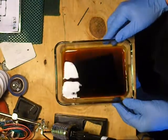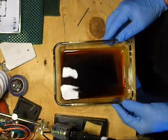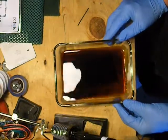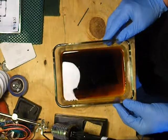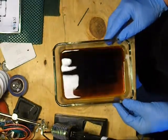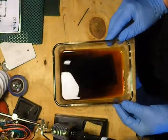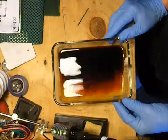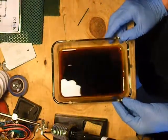It's been about five minutes now. One thing recommended that I didn't mention before: agitate the solution ever so lightly, just back and forth, creating a small little wave. It not only helps you get a better etch, but also ensures the solution is removing the copper as efficiently as possible. It's not necessary to do this the entire time, but it will increase the speed at which etching finishes. The solution will continue to turn black as you etch more and more copper off the board — that's the copper oxide forming from the etching solution.